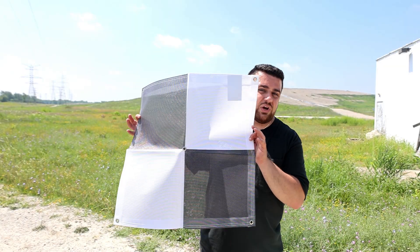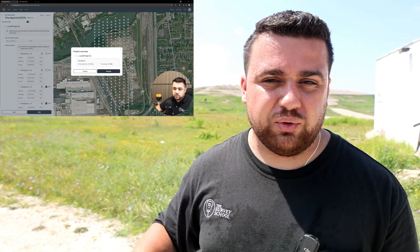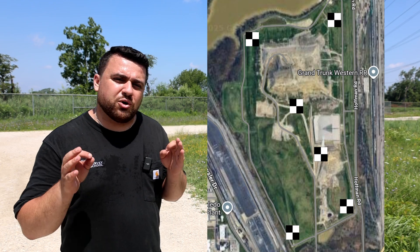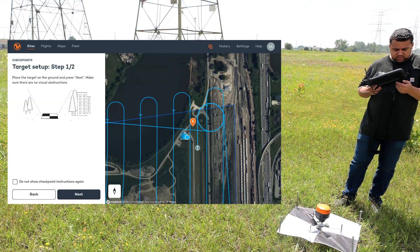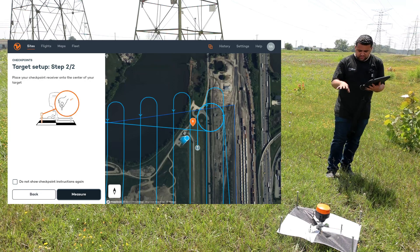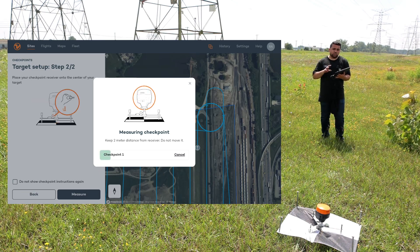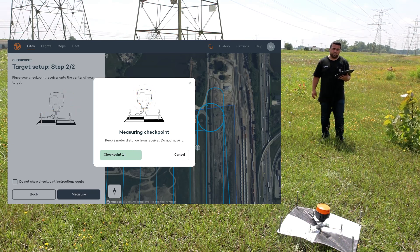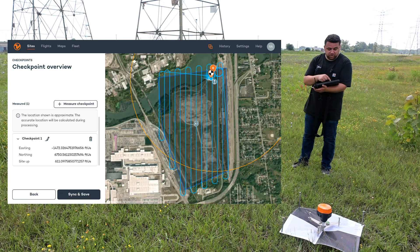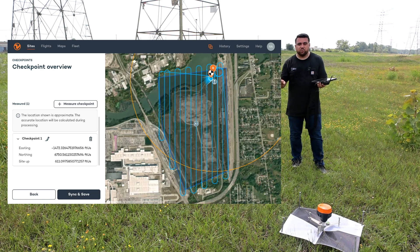What we're going to start by doing is setting six vinyl targets in the ground. To establish these points, we're going to use a second GNSS receiver that will act as our rover. You can use some of these checkpoints as ground control points later in the process. These six points will be spread out — four in the corners and two in the middle. In our controller, all I have to do is click measure checkpoint. It's going to ask that we're in an open field — yes, we are. Stand back two meters from the receiver and start measuring. Wingtra Cloud automatically starts logging data on the receiver, and once the status bar is filled up, the observation is recorded. We have coordinates for our first point, measured into the local coordinates. These still need to be corrected and processed in PPK, but that'll all happen after we head back to the office.